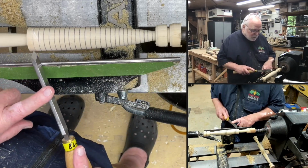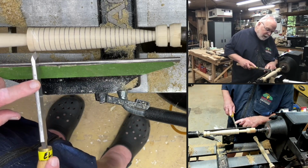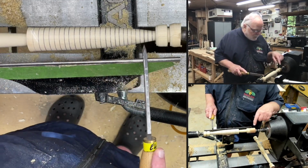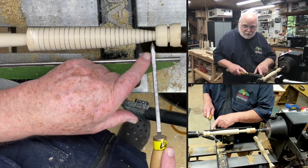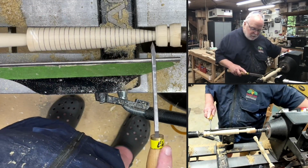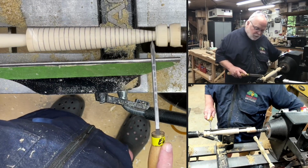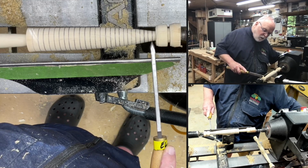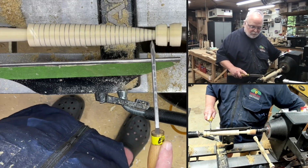When you're making these cuts down the way, you're going to come in, as I mentioned, start your cut, come down about halfway on the blank that's turning. When you get up into this area, since you're going from the multi-axis being off-center here, when you get down to this end of the blank, you're more on center. So this is turning. You can kind of see it has a lot less motion to it. So when you start to make that cut and come into here, you're just going to go down a little bit, because if you go all the way down halfway, you're going to end up making a V cut all the way around that piece there.